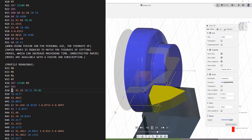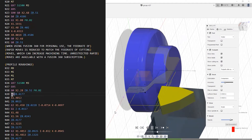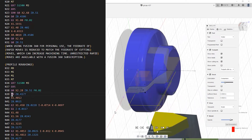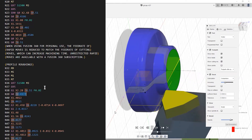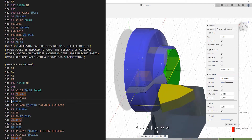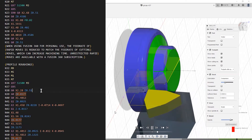A similar process for the roughing pass: we do our initial sets to G0. The Z 0.4177 value you'll see repeated through the code — this is your safe Z point. Anywhere you see one of those you can G0 to it, then set your G1 after that, and just go through each pass updating those to G0/G1. Remember to copy down your feed rate at least once so your G1 knows how fast to go.